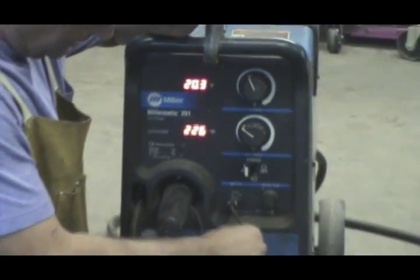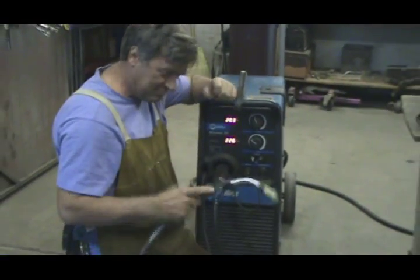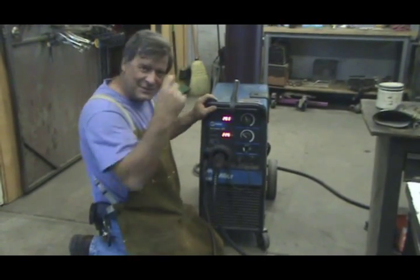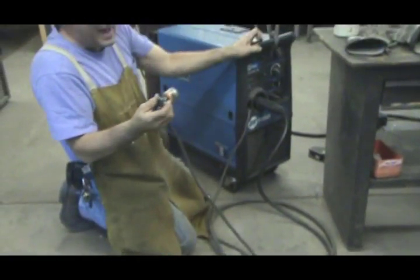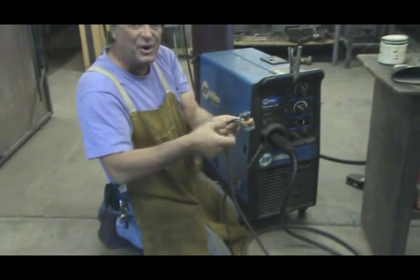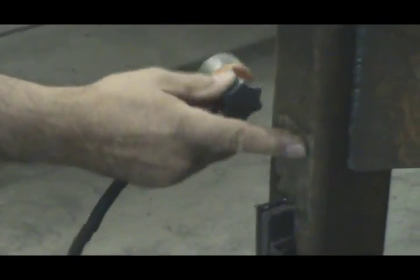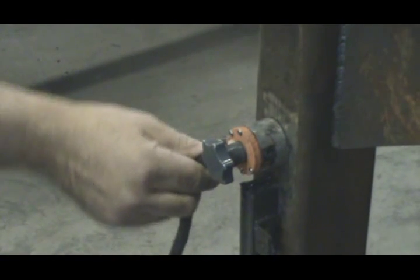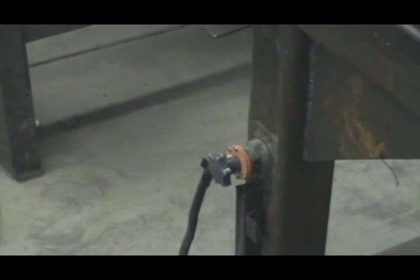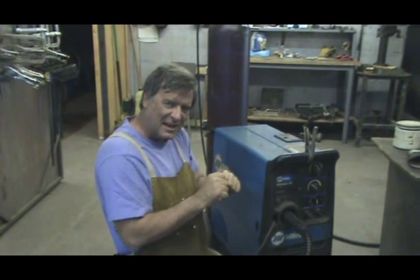You plug that in right there. This is the little connector for the trigger in the steel welding gun. And the gun — look inside. Isn't there a ground too? Oh yeah. This is the ground. Most of them have a big spring clamp, but mine wore out, so I put this little magnet on here. This is a welding magnet. All you have to do is just hold it up to some nice clean metal, like on your workbench or on whatever piece you happen to be welding. You just turn that little knob and there it is — there's your ground. Make sure you clean that metal off wherever you're going to stick it — with your grinder or a file or something like that — to make sure you've got a good ground. Otherwise you're going to have trouble.